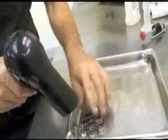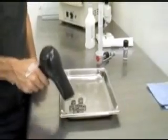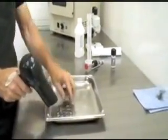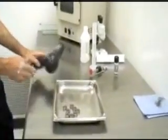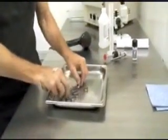Then allow the bearings to cool back down to room temperature before doing a final inspection and lubrication of your bearings. Your bearings may feel rough while still wet or hot. To know what the real deal is, completely dry and completely cool. Then inspect, then you're ready to relube your bearings.